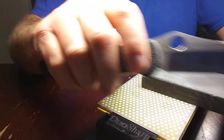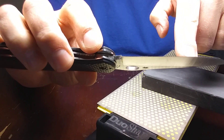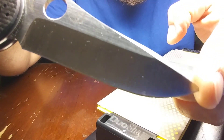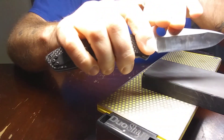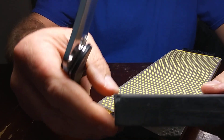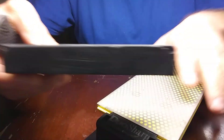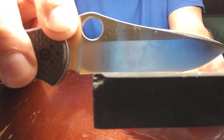So the initial problem is he thought that the back, per se, was extremely recurved. And I mean, it kind of is, but it's not really a recurve. When they run on the belt and put the edge on it, this part right back here always gets something funky. I'm going to show you guys what it is. If you get a flat surface like this, hopefully y'all can see — see how you have contact with that flat surface and the little piece hanging off the back.